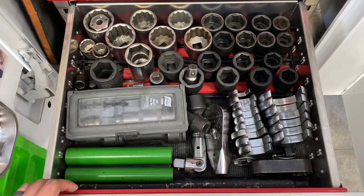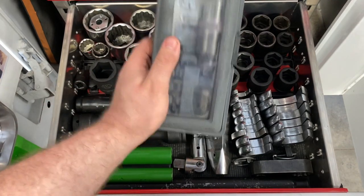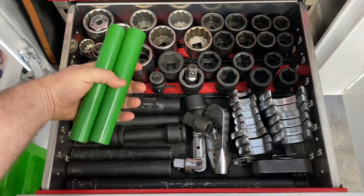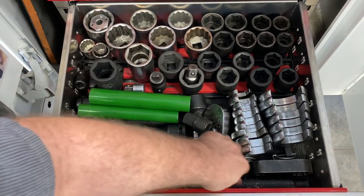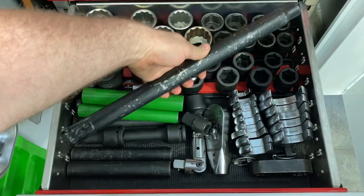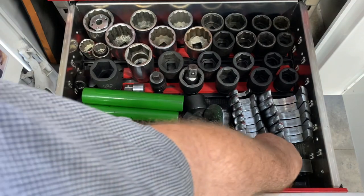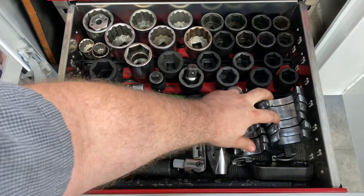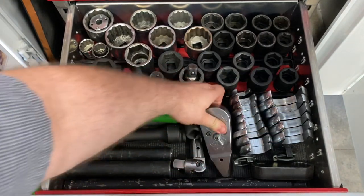Okay, this is my 3/4 drawer. I have an impact tool set. Extra long 18 and 24. Another set. Extra long 18 millimeter, 17 inches, for the chopper drive belts on S-Series combines, 30 millimeter torque adapter, Sunex crow's feet, 1 to 2 1/4 inches,